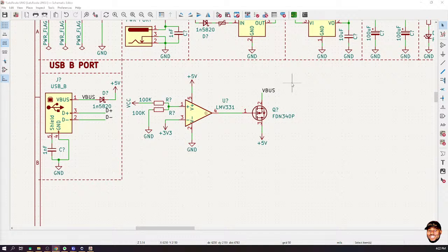Okay, but you see, the potential divider we are using here divides our voltage exactly into two. So if I put in a voltage of 6.6 volts at VCC, per this voltage divider configuration, I have to get 3.3 here. So that's what we are trying to find out, what is going to happen if these voltages are the same. If I had a simulator, we would have probably checked it out. But don't worry, I will find out more on this IC.